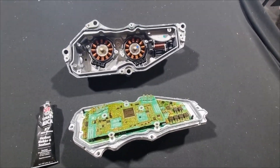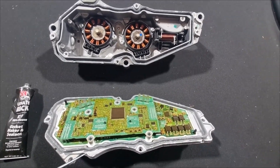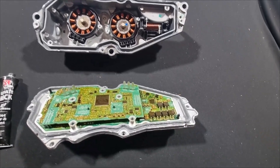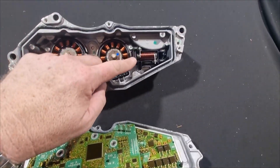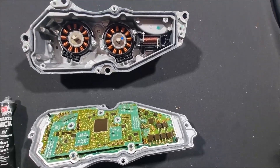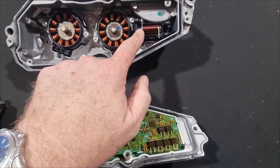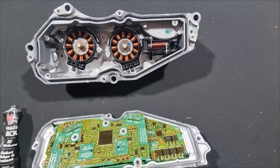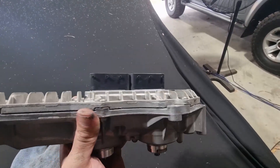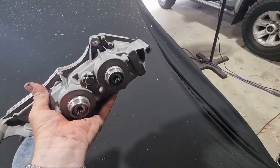We're back in the workshop, pretty happy with how that went — I didn't smear it around everywhere. Now just some room temperature vulcanizing rubber or RTV — it's just got to go into that channel all the way around and then we can screw it all back together. Care to note these pins here go into their partners on the board, so that's going to take a little care. None of those pins are bent hopefully, and we've got these little guide pins here so it shouldn't be too bad. Back together and RTV slightly squeezed out which is good, and I've wiped off the excess.